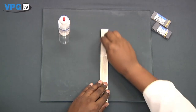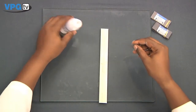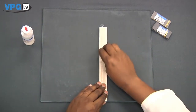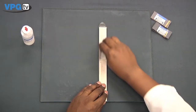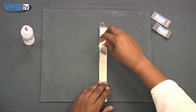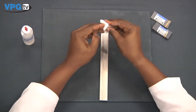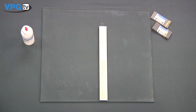After degreasing, the next step is abrading. First dry abrade with 320 grit silicon carbide paper. Then flood the gauging area with M-Prep Conditioner A and wet abrade with 320 grit silicon carbide paper, followed by 400 grit paper. Dry the specimen with a gauze sponge by wiping away from the gauging area. Remember, do not wipe back and forth as this will recontaminate the gauging area.